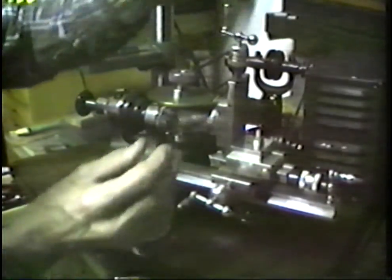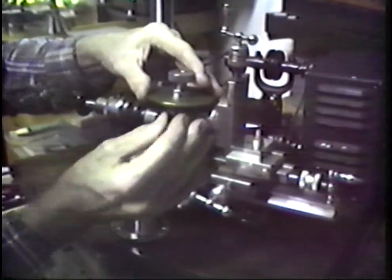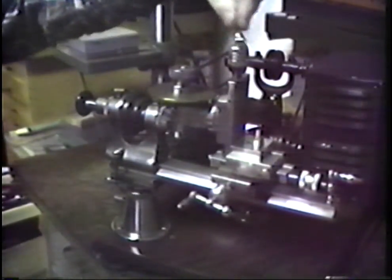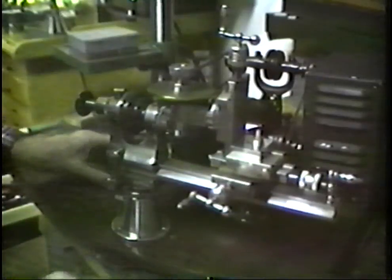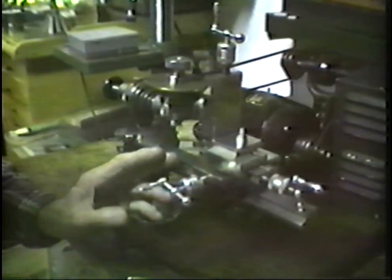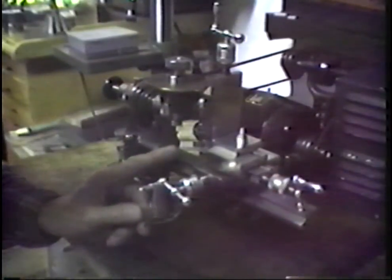We go back down, pull the index pin and rotate, pull the index pin and rotate to the next index position. The next index position may be a single hole or a multiplicity of holes, and we make the next cut. We progress in that method until we have completely passed around the gear. So we find in this instrument that we have a full-fledged wheel cutting engine. We have the full-fledged lathe with all of the handheld watchmaker type graver tools that we use.